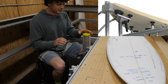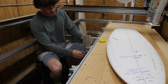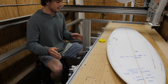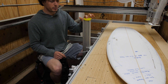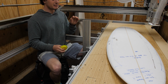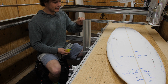My plan is I've got these four 80-20 slider pieces and I'm going to put in some vertical aluminum extrusions like this — I can slide these up and down and lock them into place to match the rocker of the board I'm going to cut out, and these also slide side to side. On top of these posts I'm going to put a suction cup to suck the board onto, and this is 3D printed. I'm going to have to set up a vacuum system so I can actually use the suction cups — building four of these vertical surfboard suction stands and setting up a vacuum pump to suck the board onto them.